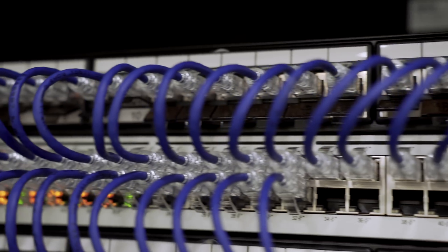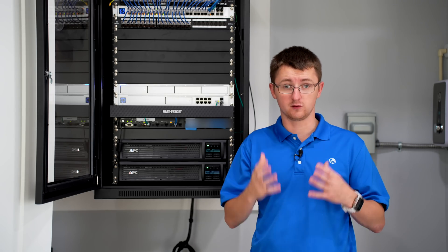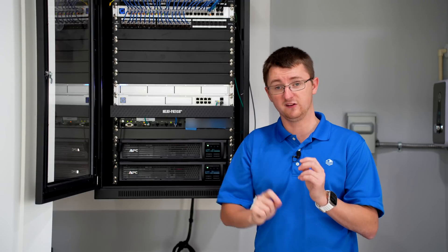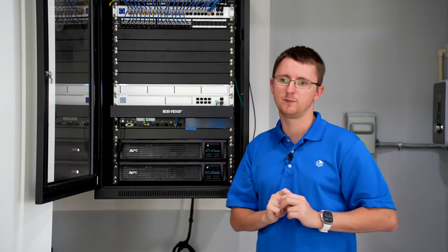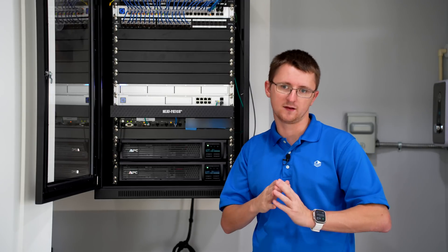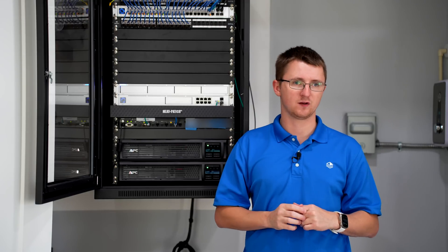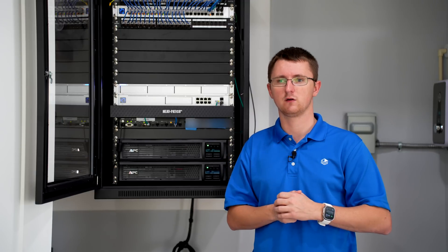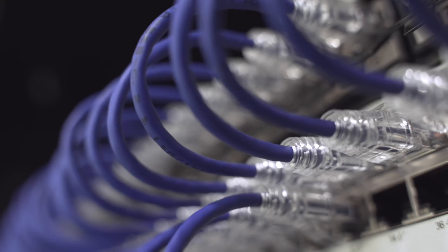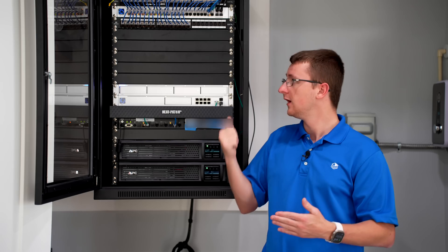At the very top we are using Cable Matters shielded Cat 6a patch panels. We've actually moved away from Cable Matters and started using more Vertical Cable — nothing against Cable Matters, we just like the Vertical Cable product better. The big reason is that all the white twisted-pair wires inside a Cable Matters cable are just white — not white-and-orange, white-and-green — just white. That makes termination really challenging. On this install, which is all Cable Matters cables, we had a lot we had to re-terminate because we misidentified wire colors.